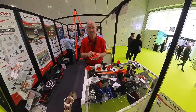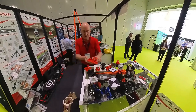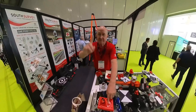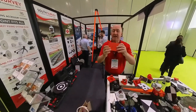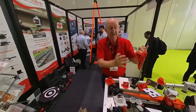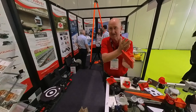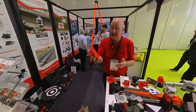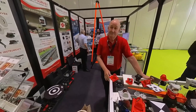Our stakeout adapter is very popular. When doing layout on the ground, you hold the controller, reach the point, lay it down, and when the fine adjustment is done you slide it in. When you need a point on the ceiling, for the first time you can do it directly – it's not heavy and it's magnetic. For height transfer there's a 50-millimeter offset, making it very easy. For stakeout on a facade, you offset by 50 millimeters to the center and it works very well. A surveyor yesterday told me he uses this item every single day.